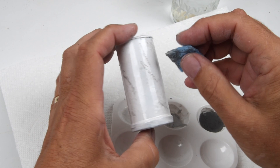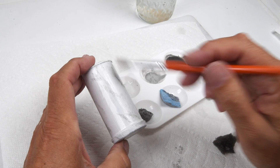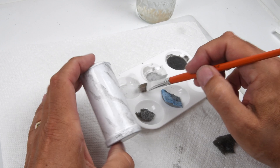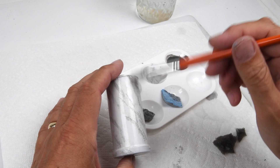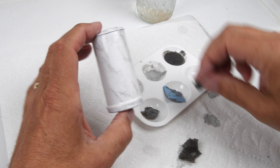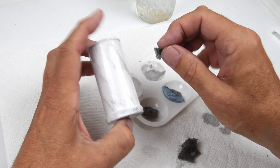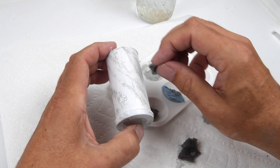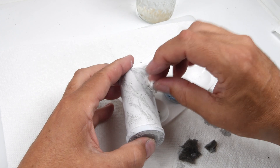Notice I'm following the same directions that I first laid down in that very first layer. Then we come back with another layer of the base color once that dries - now we're starting to add layers. These first layers will start diffusing and become very much integrated into the background, offering just that richness we're looking for. We're wet on the surface again, almost like starting over, but you can see the pattern building. Adding a little more pale gray, re-establishing some of those veins - you can see it's starting to build out, getting some of that depth we so often see in marble.